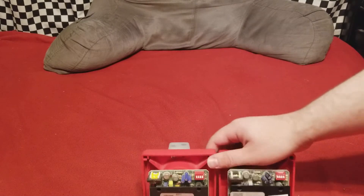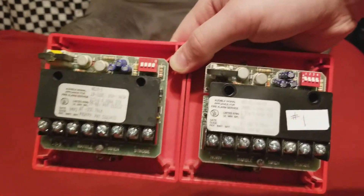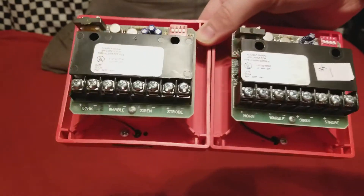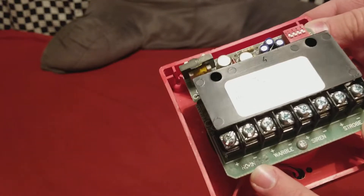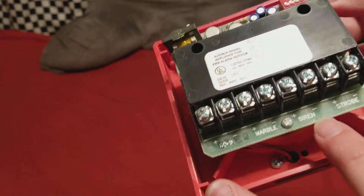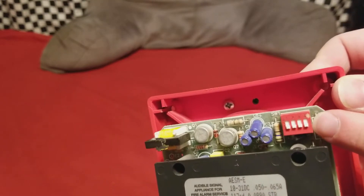Let's go ahead and have a closer look at the back of these. Literally everything on these is the same besides the strobe. Looking at the WM one: you have four sets of inputs down here — horn tone input, warble tone input, siren tone input, and then the strobe input. Then up here is a four-way dip switch.